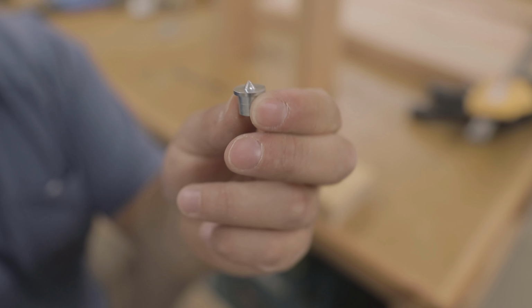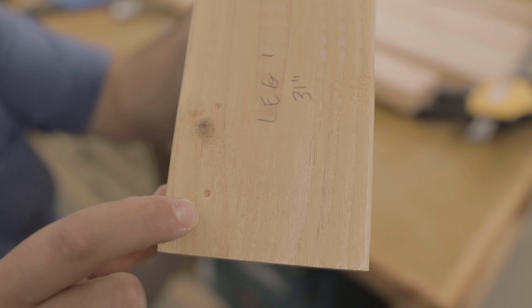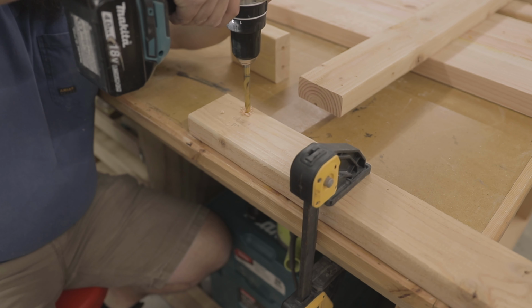After drilling all my holes, I used these handy little dowel centers to mark a corresponding point on the other parts of my base. This made it super easy to drill out all the dowel holes without having to measure and lay out each hole. In this instance, the less you have to rely on measurements, the lesser your chance of error. I'll link the dowel centers in the description if anybody's interested.